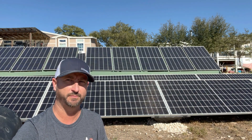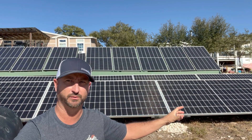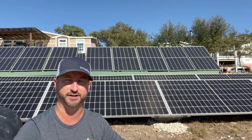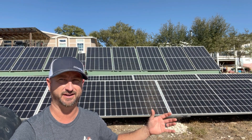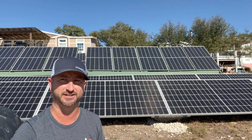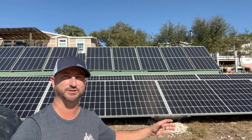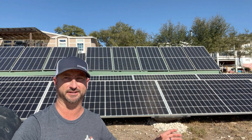If you're in an area that requires a permit for these, you're most likely going to need two racks per solar panel. Powerfield Energy will tell you exactly how many you need and how much weight to put in each one. In my area, even though I'm not in a high wind zone, I would still need two of these to hit the ASCE standard for 100-plus mile-an-hour wind rating. But even installing two power racks per solar panel, you're still saving a fortune over going with metal racking systems.